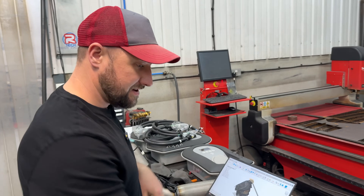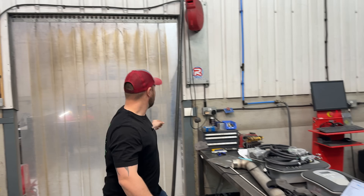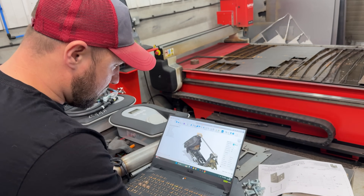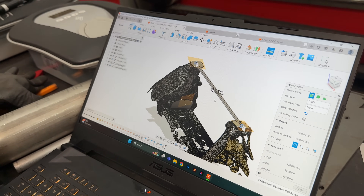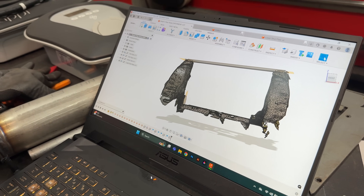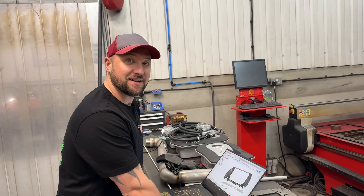Now we have our plates cut and I've roughly cleaned them up so there's no sharp edges — they've been designed in CAD. We've selected our tube and because we need to fit it into this quite small car, we need to figure out the lengths to cut. From the scan in CAD the tube I placed is 1.3 metres, so we can cut a length at 1.3. I can also sketch in the CAD to measure where we need to go for each section and get the pipes cut to rough lengths to transport back to the unit.